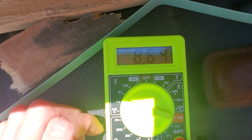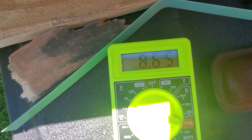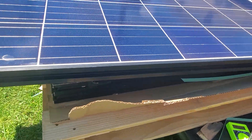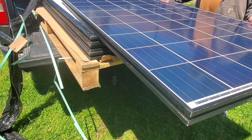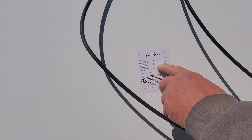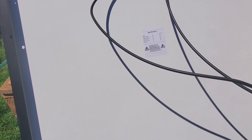8.64, 8.65 — yes! Good, try it again — 8.65. Dang, that's perfect. This is some good juice coming through these things. What I needed to test — I was saying 8.27 — my short circuit current is 8.85, and we were getting 8.65 off the first panel. So now I'm going to try this one and see where we wind up.